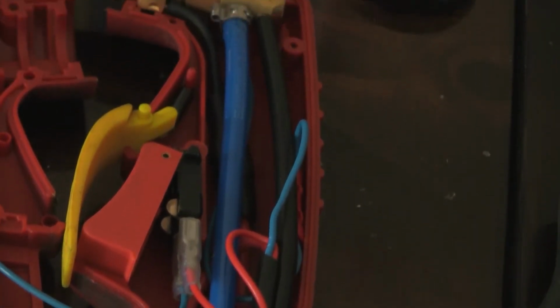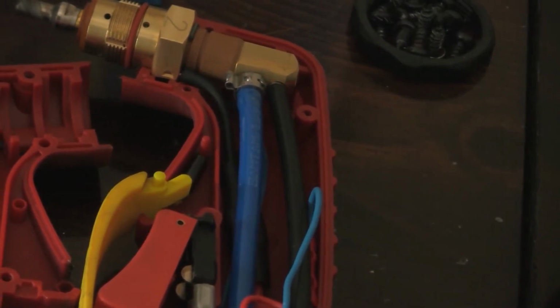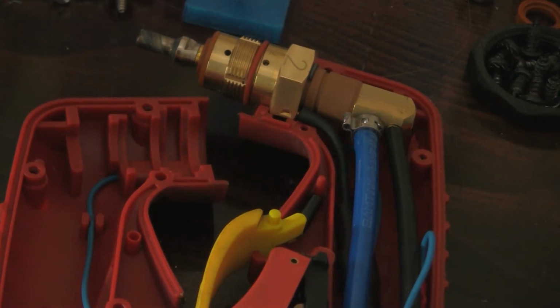This was not easy as I used my electrical 25-foot metal fish. I recommend buying a plastic one though. I took my time and I was careful, but I definitely recommend buying a plastic fish. I also fished a piece of trimmer line, so next time I need to fish a wire in, I can attach it to the trimmer line and pull it through.